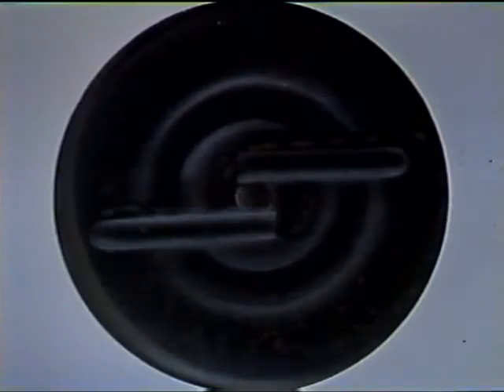If the nose core insulator is covered with a black, fluffy soot, it indicates that the cylinder was being operated with an excessively rich mixture, or again, the spark plug could be too cold for the engine. If the carbon deposits are oily, there could be damage inside the cylinder — usually broken piston rings or excessively worn valve guides. In any event, a detailed investigation should be made of the cylinder from which the oily plug was removed.